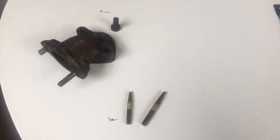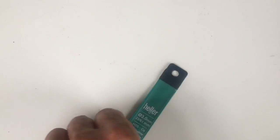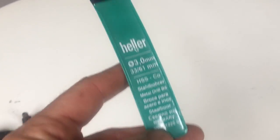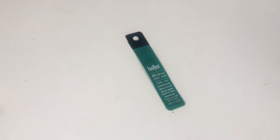If you're faced with one of these stuck in the engine block, don't bother wasting your money trying to drill them out. These drill bits are super hard, cost about £2.50 each, but they just blunt very quickly and snap.